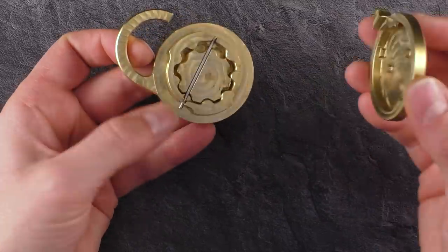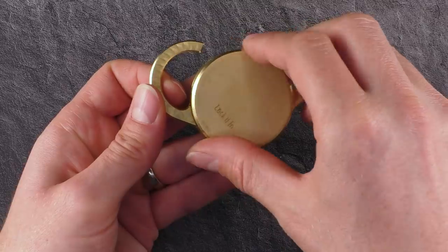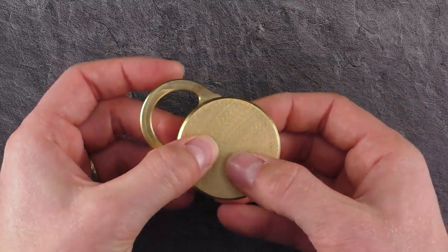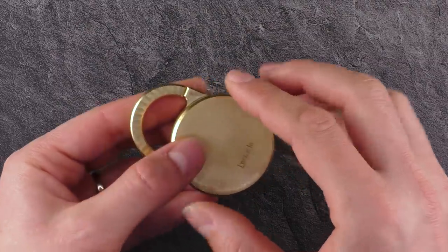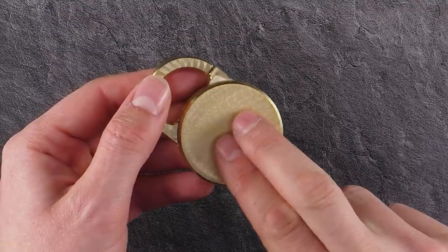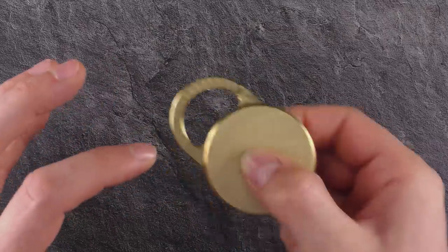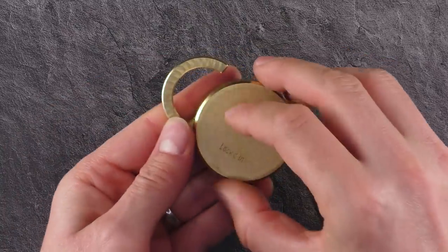I'll lock it again so you can understand the single steps. I'll put the lid on top, and the pin will now block these two wings from rotating. Lid on top, but I cannot close it. Before I can close it, I need to turn it around. Now I can continue moving it and close it, but not completely. Before I can close it completely, I need to turn it around again so the pin drops back into the notch, and then I'll be able to close it. So the pin is now inside the notch. To get it in the final locking state, you turn it so the pin drops out of the notch and rotate it — the pin is now on top of the pinion but not in the notch. And now it's locked. To unlock it — and this is very cool, I love this mechanism — I just rotate it until the noise disappears. Now the pin is in the notch, so I'll be able to twist it until here, turn it around, continue twisting, and the puzzle is open again.